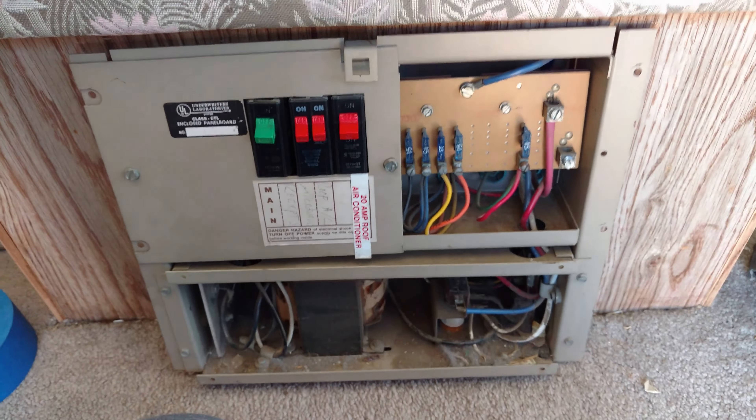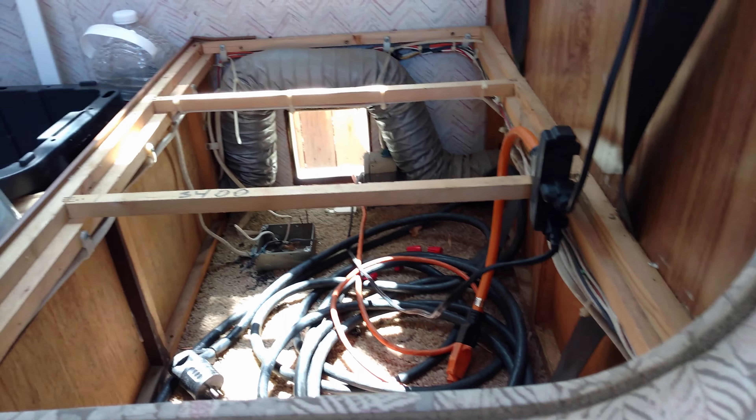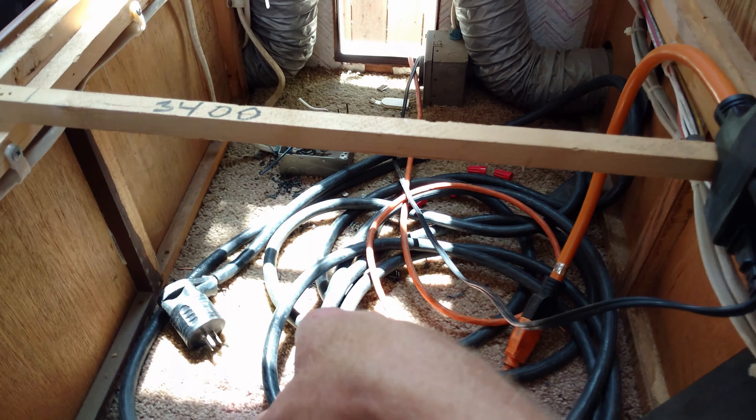Should be exciting — this is some advanced wiring, but it's doable. That's all my 12-volt stuff on one side. That box right there went straight down to my generator, so my generator wires went in that. Some of this stuff is going to come out, but the wire is still good so I'm going to still use it. Any outlet, double outlet that you plug in, I'm going to replace those with the GFI — the newest, safest ones. I'll replace all my plug-in outlets, only about three or four in the RV. The wiring is still good and I'll go through and check it too.